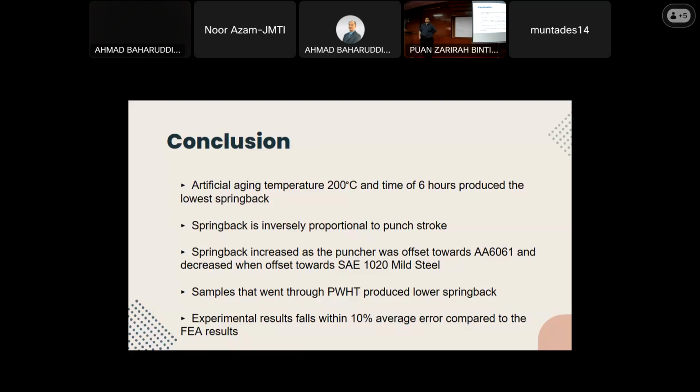Do you expect any compound to be produced? I mean, if the test is positive, you have some expectations, right? So it is possible to observe the compound and expect a compound to form. During the friction stir welding, the tool has softened and mixed these two materials inside the weld line. So the weld line actually consists of both materials, a compound form. Yes, yes, right.